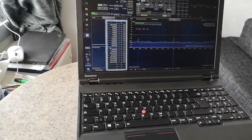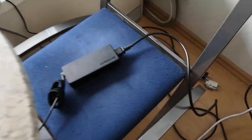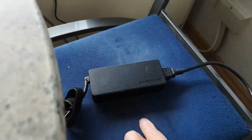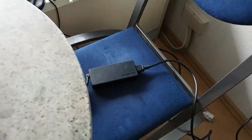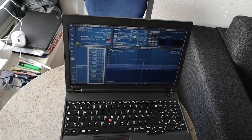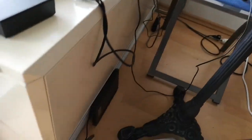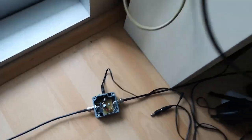I also had to experiment with the laptop power supply. An old 95-watt Lenovo supply seems to produce lower noise than a more modern 65-watt supply on the floor, which produces horrendous amounts of noise. When I was charging the laptop on that supply, I couldn't hear anything — as soon as I unplugged the charger, the noise disappeared. It's really quite critical to play around with noise sources, and also to use the ground-isolating jumper.